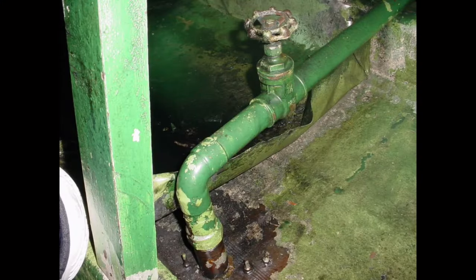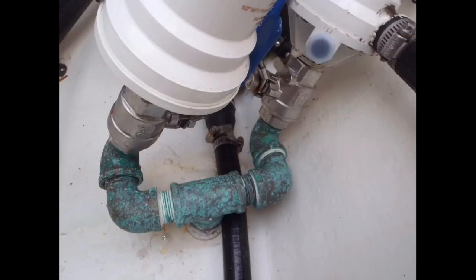What we have here is a seacock installation that employs two short sections of piping and a 90-degree elbow between the seacock and the through-hull. The problem is that this introduces a possible point of failure that is not protected by the seacock. In other words, if the piping fails or cracks off, then you have no seacock there to prevent water from entering the vessel. The seacock should be mounted directly to the through-hull — that way you have no additional points of failure that are not protected by the seacock. This second photo shows another example where a T-fitting splits the through-hull into two seacocks, but neither one could prevent water from entering the vessel if the T-fitting itself failed.